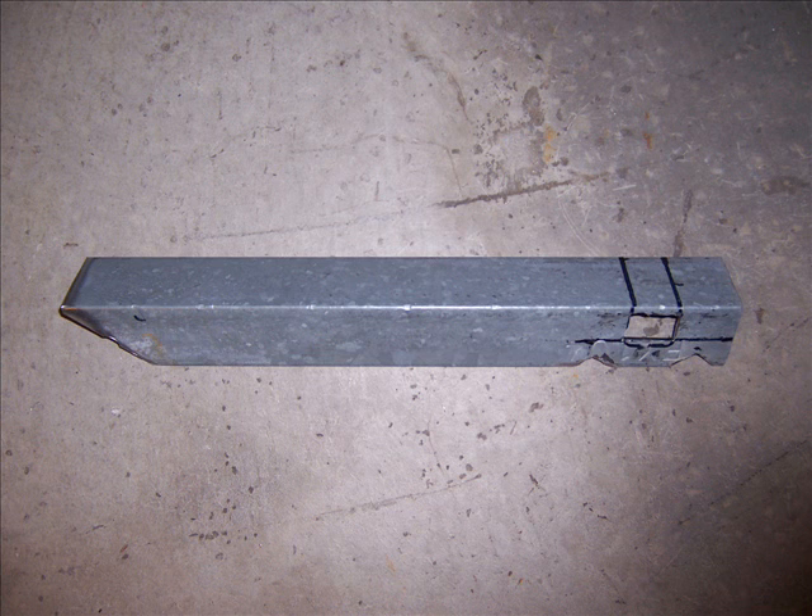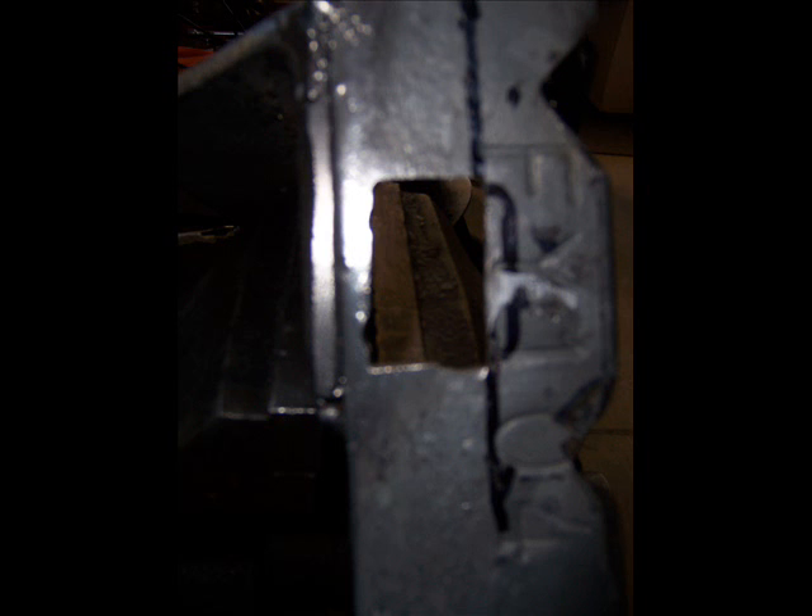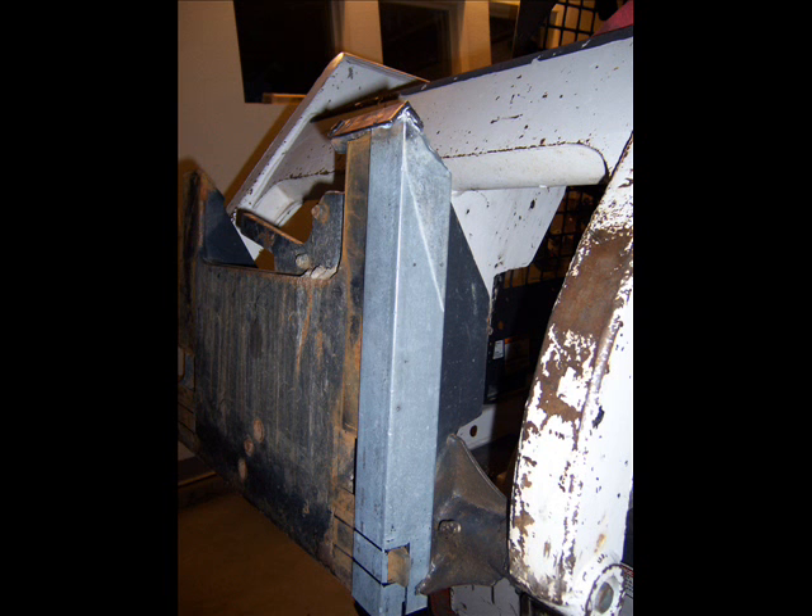All I had in angle iron to make the side mounts was galvanized. Here are the side mounts with the holes cut in them for the latching pins — I drilled and filed those holes out. It was pretty easy. I made sure that these pieces of angle iron would fit flat up against the bobcat mount. Then I welded — there is the piece of galvanized iron with the latches fitting through it just to show you how close it fits, and my marks on it.